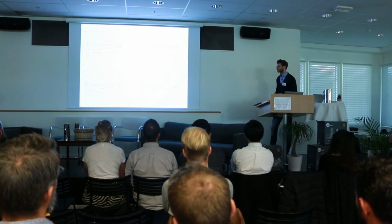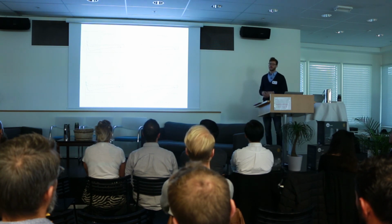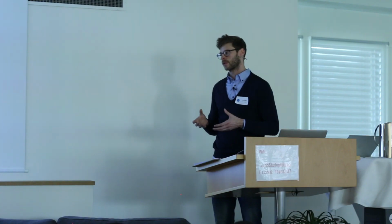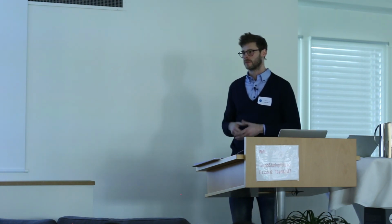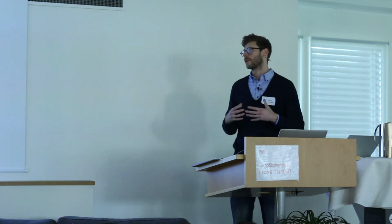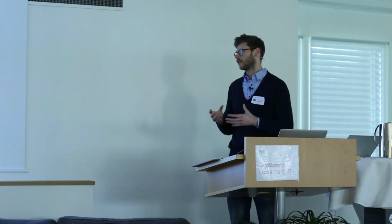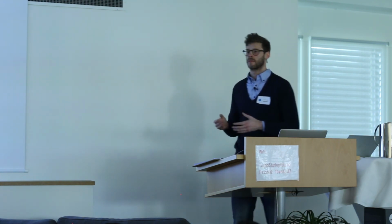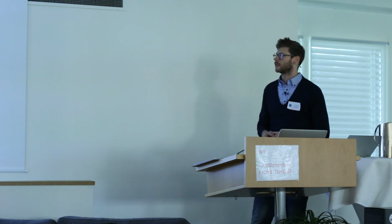Manual roasting is actually where we have the biggest challenges. If you look at manual roasting, you have what I would call an open loop control system. That means you're adding a fixed amount of gas, but you're not reading any of the values from that point on. So in order to have a closed system, you have to be the one paying attention to what is happening and adjusting the temperature and airflow accordingly. But humans are humans, and we don't pay as much attention as a small microchip could.